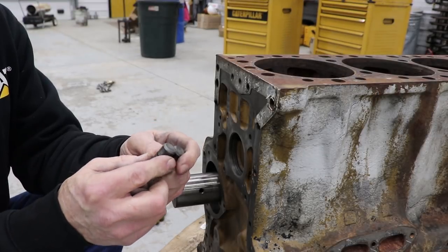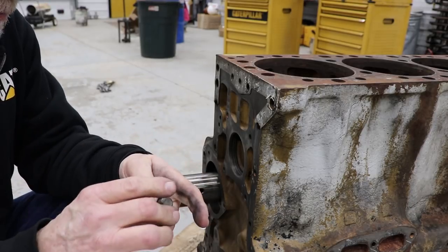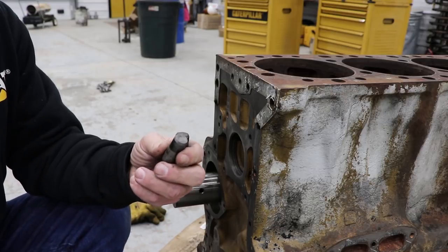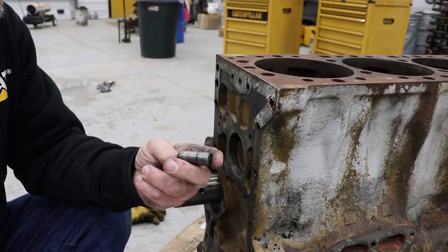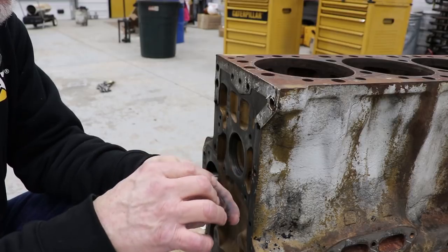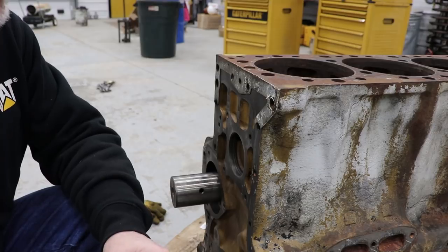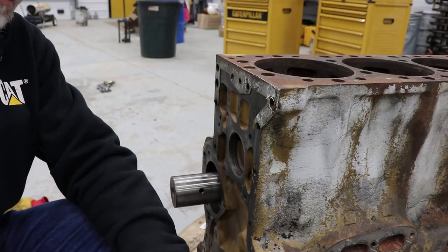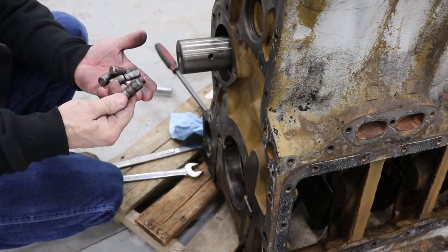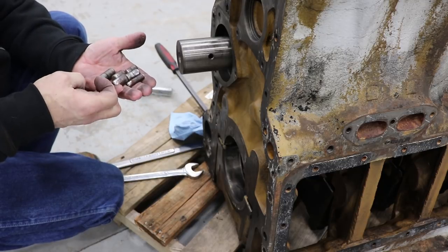You're asking yourself: Jeff, how do you know where those go? For a lot of that information I'm going to rely on the parts book. Cat parts books — especially the old ones — are really good for telling you the length of the dowel. From these holes I know which dowels go where. It's just something on the checklist you have to do to make sure you've got them all in. There are all the dowels I pulled out of the block.